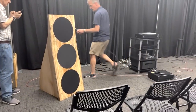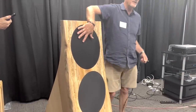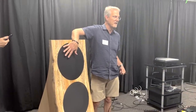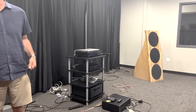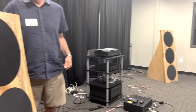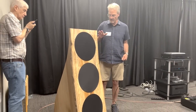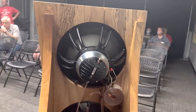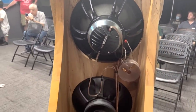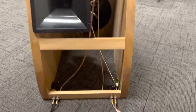When the dynamic range ceiling is literally 30 dB above what you're listening to, anything you're listening to sounds incredibly lifelike. I also believe that open baffle speakers that are only open baffle over part of the range don't sound right — if they're not dipole across the entire range, they sound funny to my ear. So I have a horn tweeter on the back that roughly matches the response of the coax tweeter on the front.